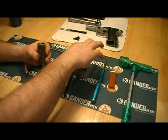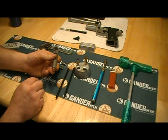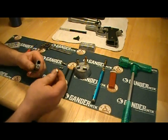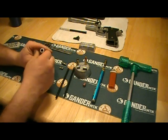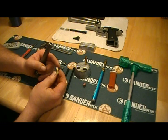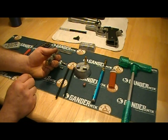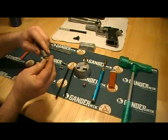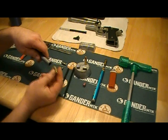What got me started on this is if you take a bullet, brand new, it almost fits into the barrel. So that's a good starting point — we want something about this size. The problem I was having was that I didn't want to take a hunk of lead that was much bigger than the barrel and try to jam it in there. If you take a case — 9mm is head-spaced on the front of the rim. That's what stops the case at the proper point inside of the barrel. So where the bullet actually feeds into the barrel, this fits in perfectly, but obviously it doesn't fit into the barrel. And that's what gave me the idea of using this as my casting crucible.